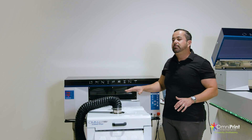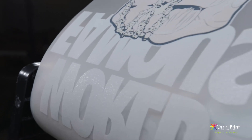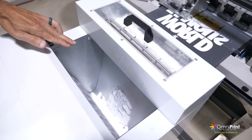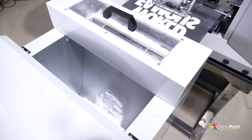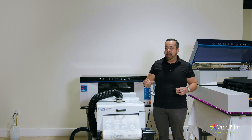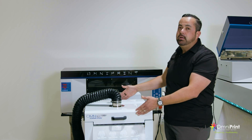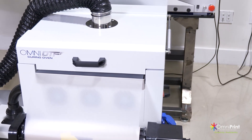There's an adhesive that goes in the back of your image so that it's able to transfer and stick and wash really well to any sort of garment. So it's applying this powder — you guys will see from the close-ups that it's a reservoir where you're going to be pouring in your powder and it's automatically applying it as you go. There's also a part of the system that's actually getting rid of any excess powder that's in the design so that you can have nice crisp lines — it's literally smacking the film and getting rid of anything excessive. Next we go to the oven.